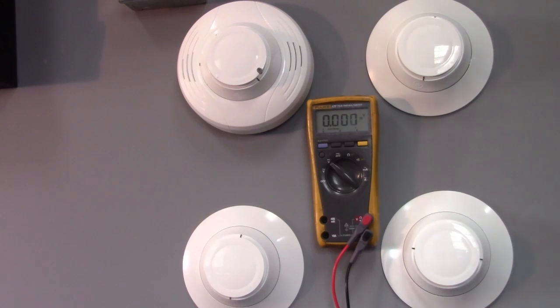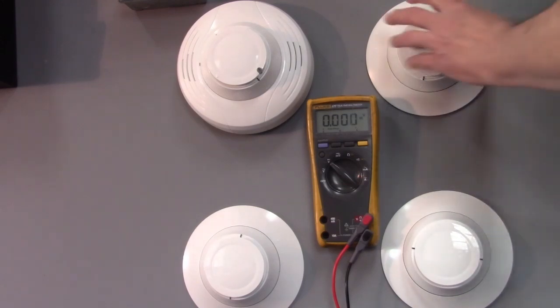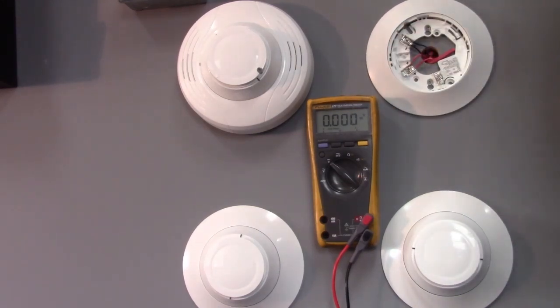To locate which device is wired up backwards, you're going to have to walk away from the fire panel, go out into the building where that signaling line circuit covers. You should be able to tell if you're in the right spot or area, because none of your devices are going to be blinking. None of them are communicating with the panel right now because one of them is wired backwards. So what you do after you've examined the area of the building, determine, take a best guess, where is halfway, take a device down and open up the circuit.